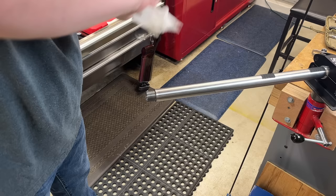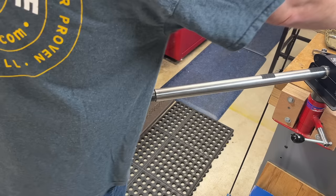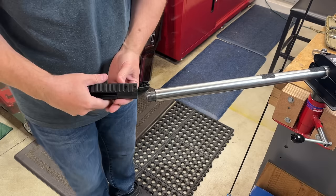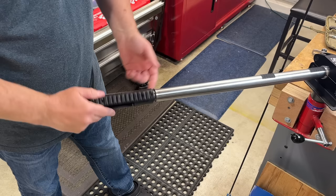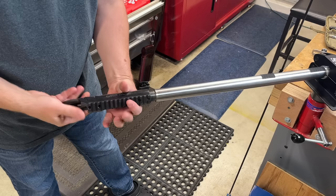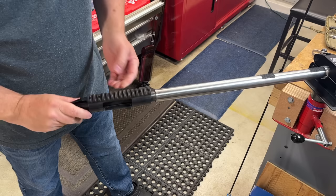Then I have my action. I'm going to do the same thing here in terms of wiping it down — I'm just going to clean the face off. I always stick a towel in here and just clean it out because you never know what's in there. It's a little extra greasy because I forgot I was swapping barrels and I actually greased the lugs already. So I've cleaned the face off and I've cleaned the face off the shoulder. Some people put oil on the threads — I've seen just about everything. And then if I'm ever in question, I can always take a look and see how much of that anti-seize got spread around. If I don't think it's enough, I could always put another drop on.